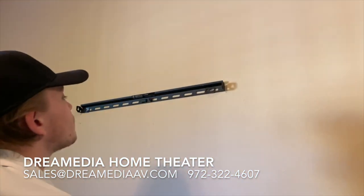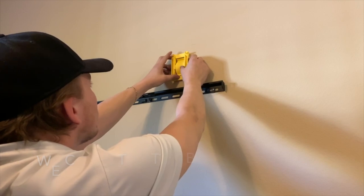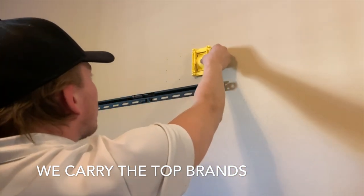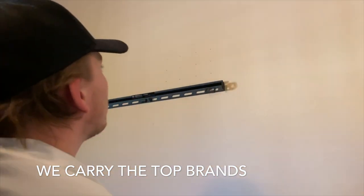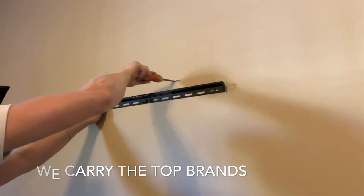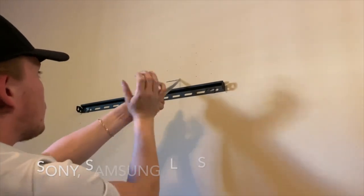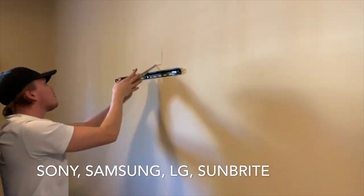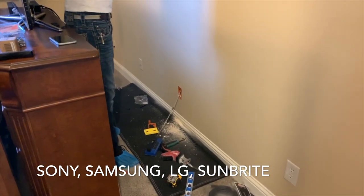The next step is going to be cutting our holes up top for our power outlet as well as our low-voltage wiring to pass through — that's two single gang holes. You can take your little template and get it marked out. Make sure you don't go too close together, because when you cut the sheetrock, sometimes you can break the sheetrock in between. Give yourself at least a couple of inches. It doesn't hurt to have a drop cloth on the floor to catch all the debris so you don't have to vacuum it up later.